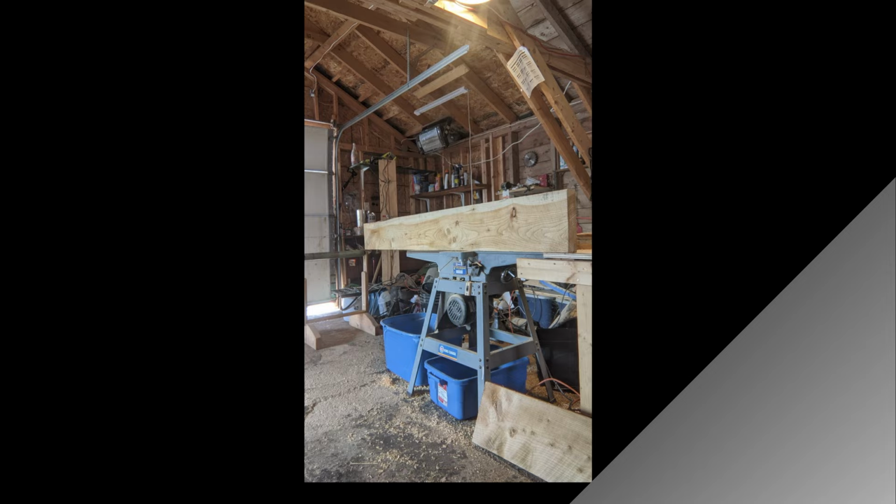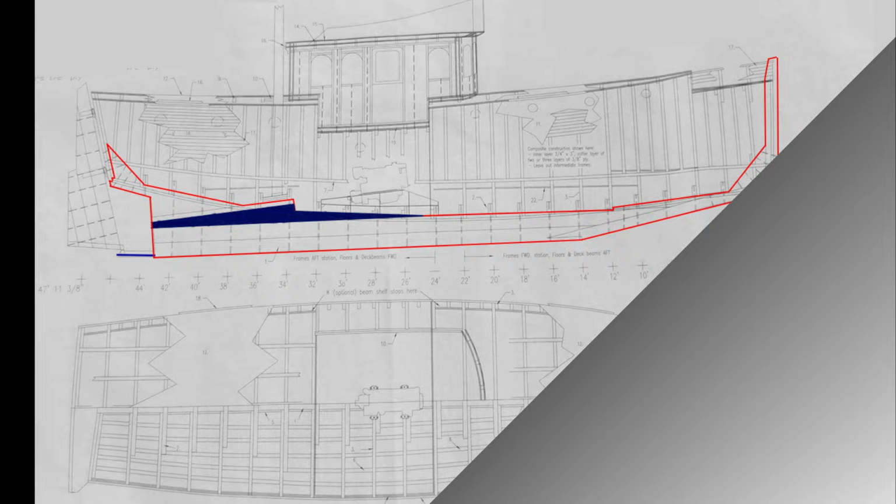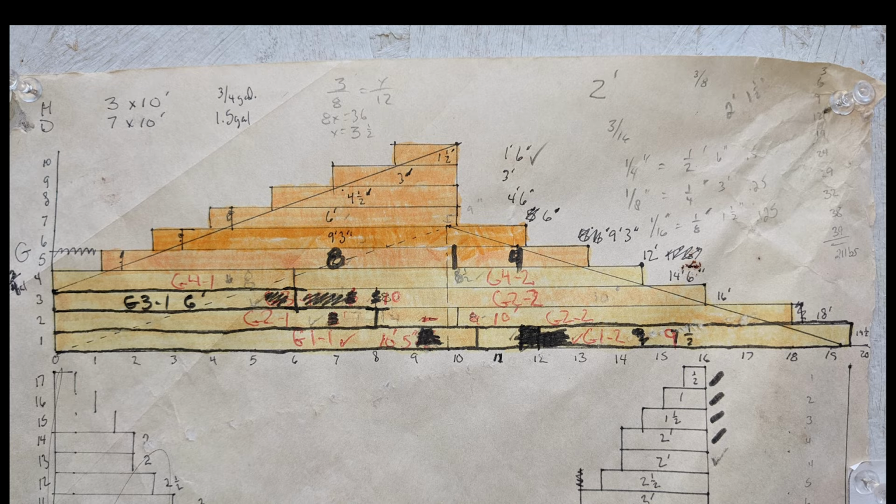As I was only able to glue a maximum of 12 feet of ballast keel timber at a time, due to the limited number of threaded rod clamps I had on hand, I was able to work on the final two keel sub-assemblies concurrently. First was the 18-foot-long lower shaft alley assembly. My handy, but not to scale, visual of the timbers was always a great reference. And before too long, the full assembly was completed.